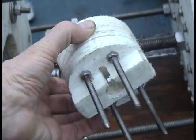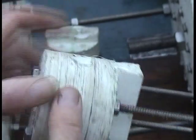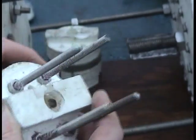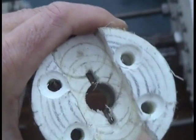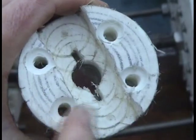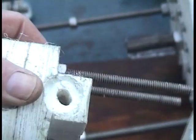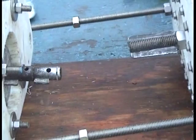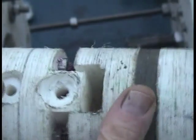Here's what I'm going to call the coupler hub. This one mounts onto the forklift motor shaft — you can see I have two holes drilled all the way through. And this one mounts onto the stub axle; I have that cut out for those two long keys. The quarter inch wide bolts are going to go all the way through and I'm going to bolt them here. So this fits on there like that, this fits on here like this. I cut a slot out here, and these are going to be flush when they're in there.